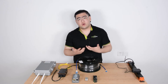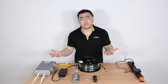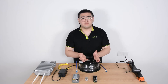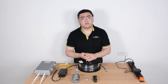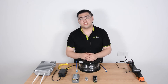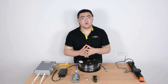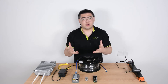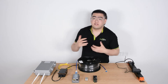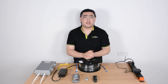For setting up a wireless access point, usually we would think of just using ethernet cables to connect it. But when we want to set this up deep in the woods or far away from our main network, we may exceed the 100 meter limitation. POE technology, which transmits power and data through one single ethernet cable, has a lot of benefits but also one problem — it cannot go further than 100 meters.